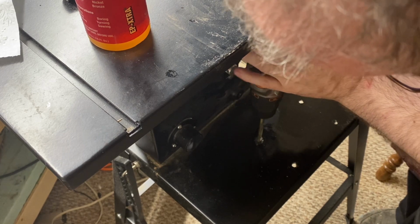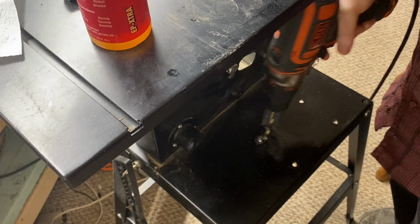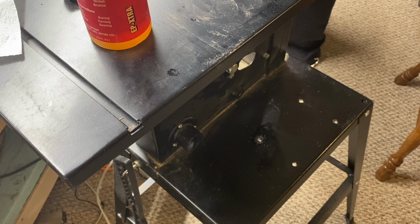And then next up will be checking whether or not the shaft can fit into the opening in the side there headed toward the wheel without making contact, and realizing that I did need to use a Dremel tool to remove some material from that hole in the side panel so that the shaft would not grind and make contact against that side panel.